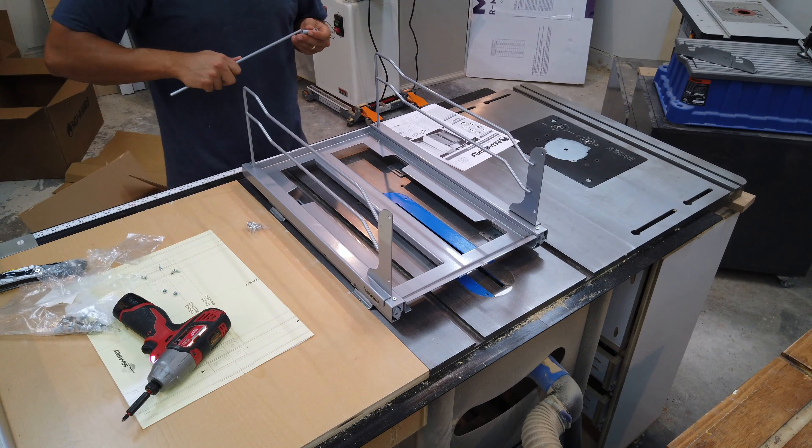Here's a quick overview of where we're at. I went ahead and installed this door. I used tape here to mark off where I want the edges of the door to be — I just mark it off and line it up. Rev-A-Shelf gives you one of these templates that you put down in the bottom of the cabinet and it helps you line up where your rails are going to be. Basically you just drop it in, line up the rails, drill your screws, and attach the door.